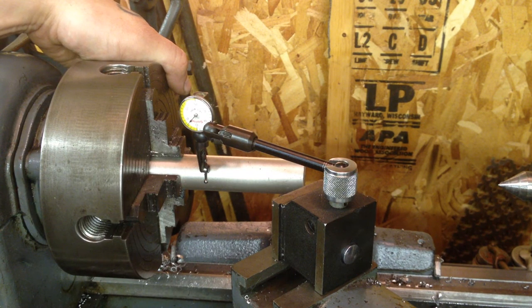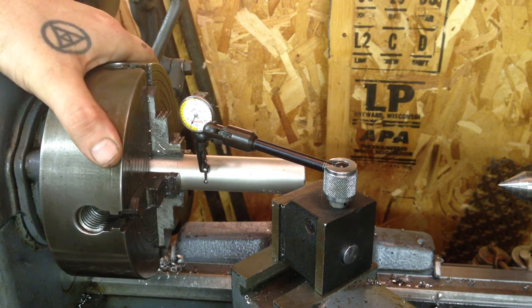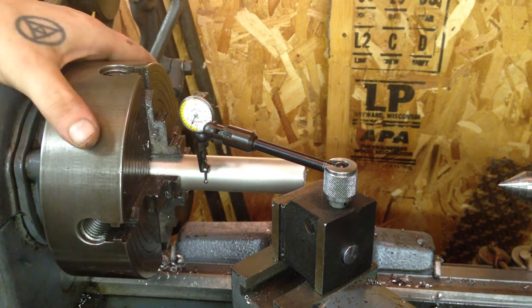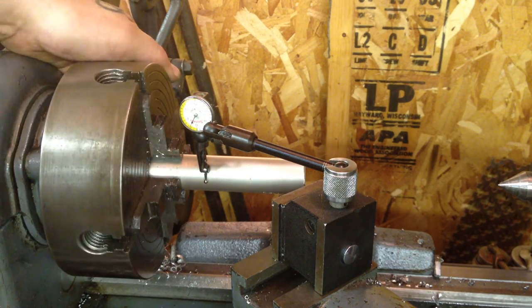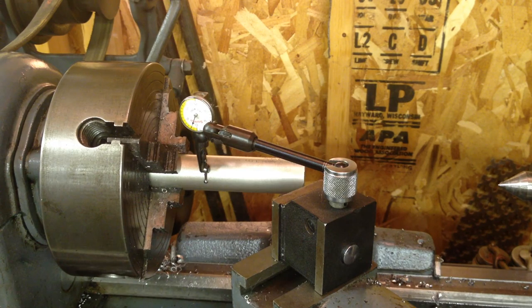I could back it off and get everything to balance at zero, but then I'm not sure if it's dipping below zero. So I like to stay at a whole number above zero — somewhere between one and five. Since it dips below zero, I'm going to aim for three. Three in the front, three on the back. Go to the other jaw — we're at three, a little over three. Super close. In a case like this I'd probably call it, loosen the back a little bit, and that's pretty good. I'd tweak it a little, then go ahead and face that piece of stock, put a live center on since it's a little long, and start machining the front. So that's about it — I'm going to go ahead and get started on a couple of pieces and go from there.